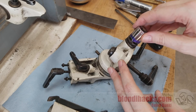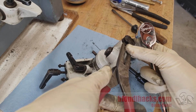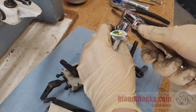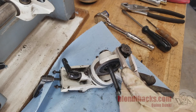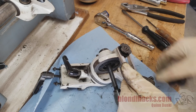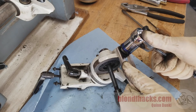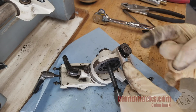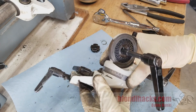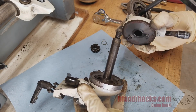I thought I'd try my needle-nose pliers trick again on the other nut while pulling against it with my new socket — but of course you know how that's going to end; that didn't work at all, and we have a little more chowder. I was just about to make a spanner wrench for that lower nut out of bar stock when I thought I'd try the last refuge of the scoundrel: the vice grips. And honestly it didn't take a very tight grip at all — that didn't even mark up the nut — and that guy came apart like a boss. That was a good moment. With the big mystery spanner-nut things removed, the whole assembly slides apart like a charm. There's a little bit of rust in there but things generally look pretty good.